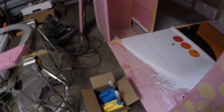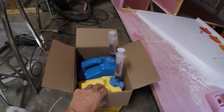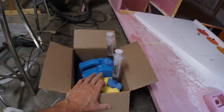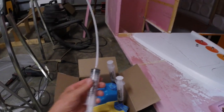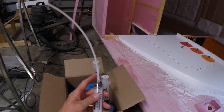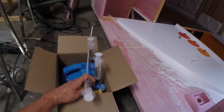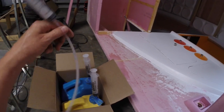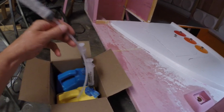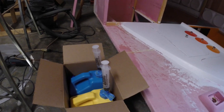Here's my foam. Because this foam reacts with moisture, you want to keep it sealed up. I use syringes — I put a tube on the end and then use some putty to seal the tube into the container so it sits down inside, and then I can pull up the syringe and draw as much material as I need.